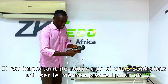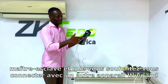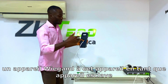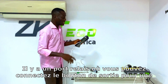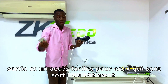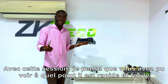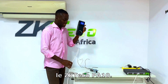It's important to note that for those interested in using this device in a master-slave configuration: you can connect another Wiegand reader device for exit, or connect an exit button. At the back of this device there is a port to connect a Wiegand device as a slave, making this the master. There is also a relay port where you can connect an exit button for easy access for those leaving the building.